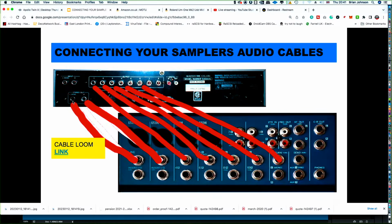So what you do is you'd wire your left and right stereo out, one there into line 1, then line 2, and then on the 1, 2, 3, 4, 5, 6, 7, 8, you could wire it as number 1 to here, and so on and so forth. But another way to do it as well is you could probably put these stereo left and right out, just for organization purposes, on the 9 and 10 of your mixer.